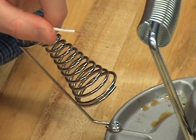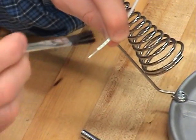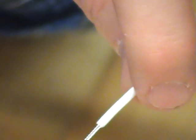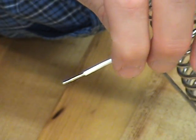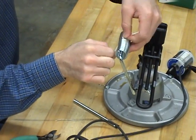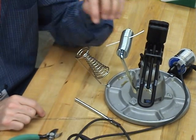Now what I need to do is clean the wire. I'm going to take my alcohol and clean it so it doesn't oxidize. I'm going to add flux — lightly add the flux. I'm going to place it into my wire holder and I am all set and clean.